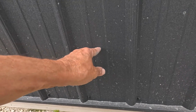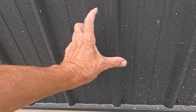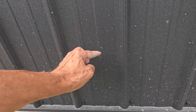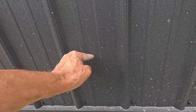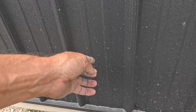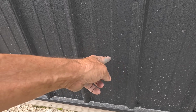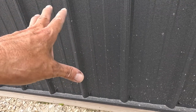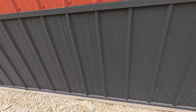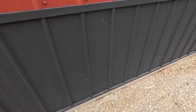There it is. The first thing I really need to do is enlarge this hole, because once I have that wood piece behind there, I'm going to have to put that in place and then trace the circle onto it, and then get that drilled, and then I can put the PEX and stuff on the faucet itself, push it through, and get the screws on, and that'll be it for out here. We'll put a little bit of sealer on the top of it as well, and then on the inside we should just have to hook up the PEX lines.